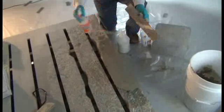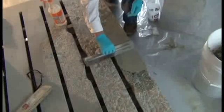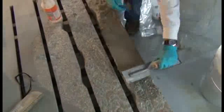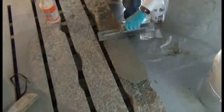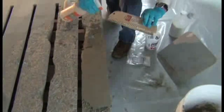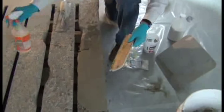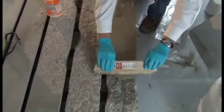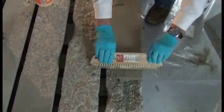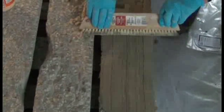For a smooth finish, we will lightly wet our trowel with the spray bottle and pull the mortar out flat, using as few passes with the trowel as possible for optimum finish results. When a non-slip or textured surface is required, we can use a moistened, stiff bristled broom. Pull it across the surface to leave behind the desired texture to add slip-resistant texture or in preparation for epoxy systems.